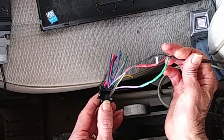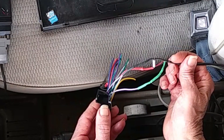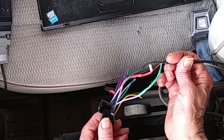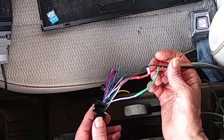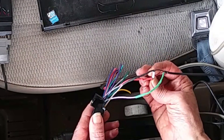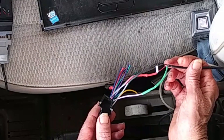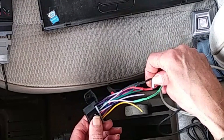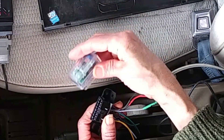There are two CAN bus cables coming from the BMS — one is terminated, one is unterminated. The terminated one I'm already using for the USB connection to the computer, so this is the unterminated cable. Theoretically you're supposed to have 120-ohm resistors at each end of the cable. But to put a 120-ohm at the BMS end I'd have to cut and splice the cable, which I don't want to do. So I'm just going to try putting one 120-ohm resistor here at this end. That's all wired up; we just have to plug in the adapter and give it a try.